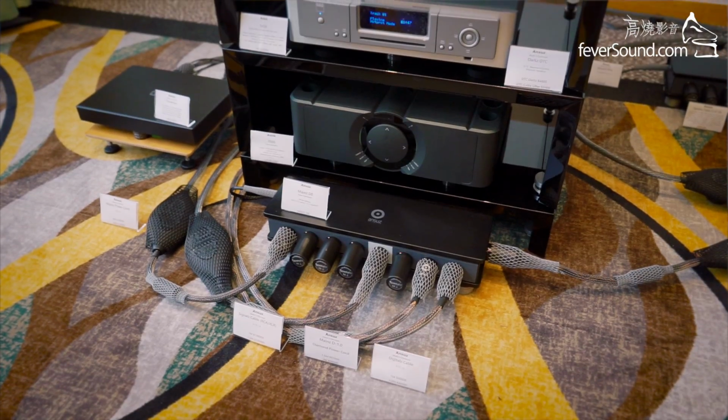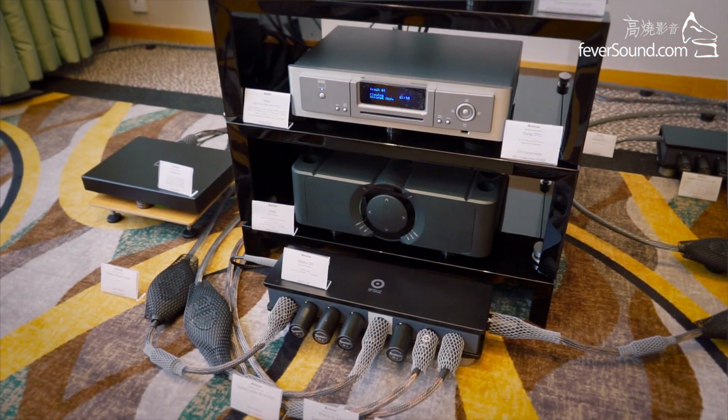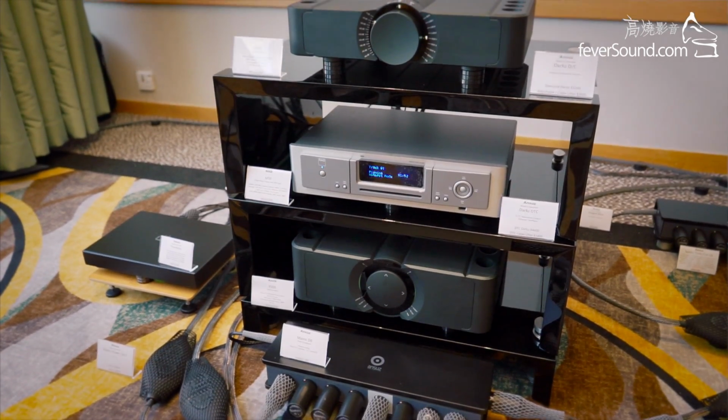The system we're playing here today is a Class AB. It's a new Aavik power amp and a new Aavik preamp. And the power amp, it is a Class AB, but it's actually not switching. So in essence, it always runs with more current through the output stage than what the speaker draws. And in that sense, you could say it always stays in Class A because none of the output devices ever switch. And for me, that's the purest type of amplifier you can get.